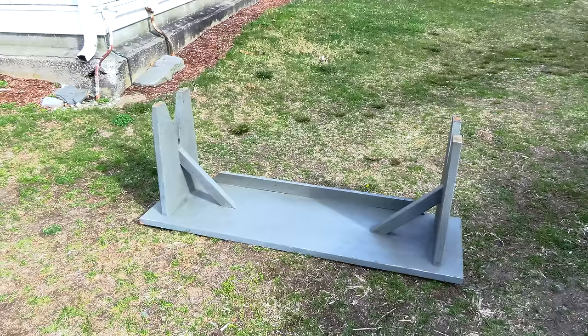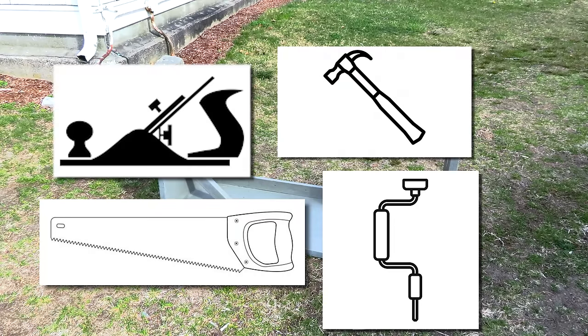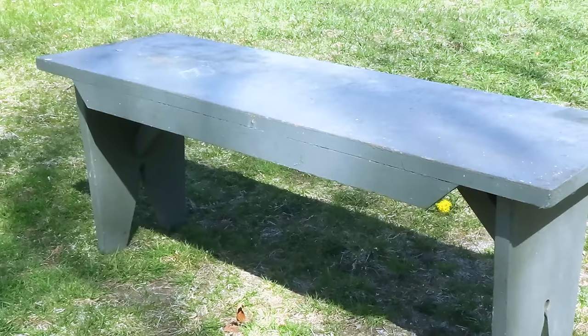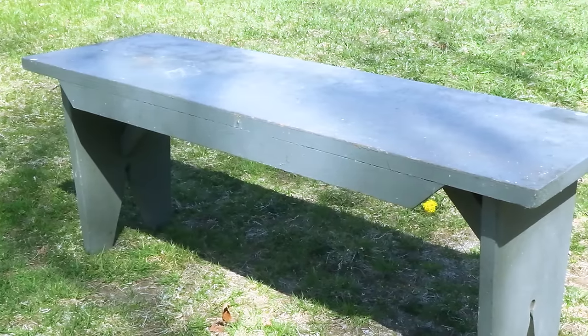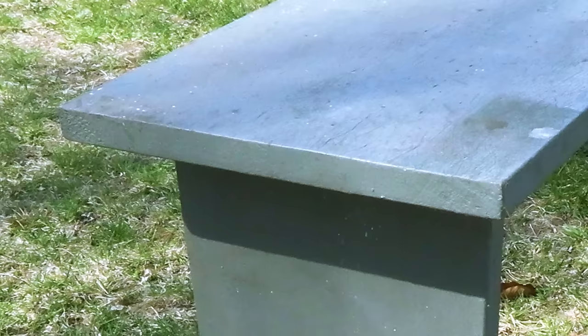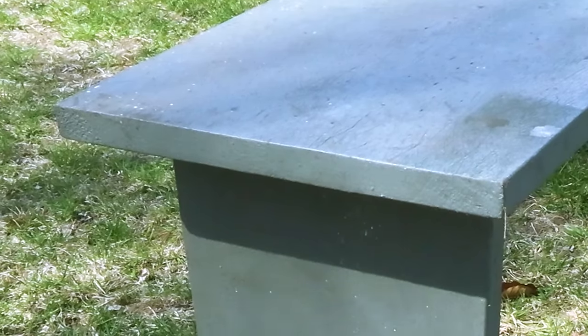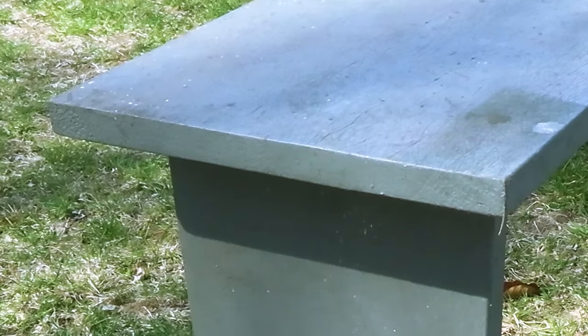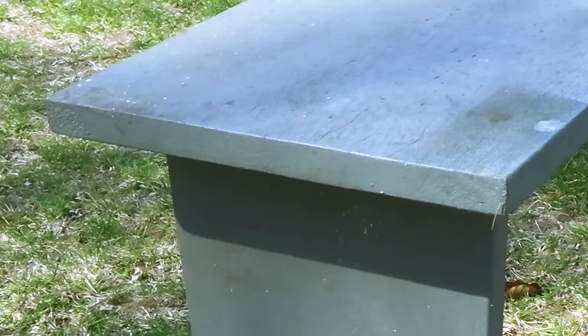Looking at this bench, it's obvious it was built with a jack plane, a saw, a hammer, a brace with an auger bit — and that might be it. The two braces are not glued, just nailed, but the construction is rock solid and doesn't move at all. All the edges have been neatly chamfered with a hand plane so there's nothing to splinter you. Most saw cuts are still visible to the naked eye — not cleaned up with the plane, but nice and neat, showing the carpenter used a sharp, well-tuned saw.